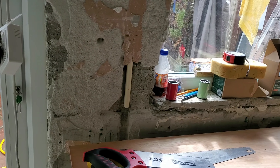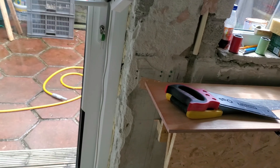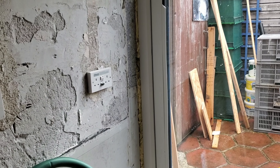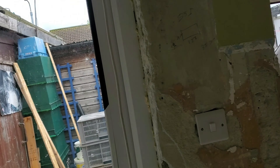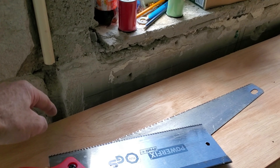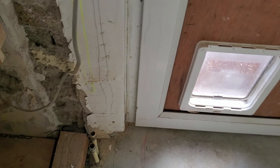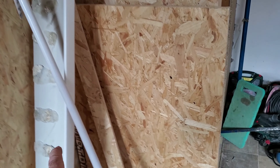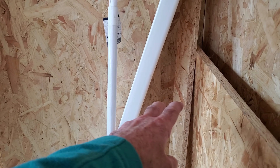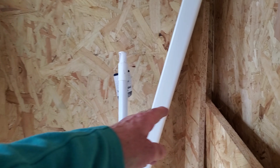As long as the sockets and stuff's done. I extended that down, so if I run a double socket underneath — there's the electric screen on a ring circuit. The cable comes down to that and the cable comes back up again. I'll bring the cable down here, the socket — the cable will run along the back — and then I'll have another socket here, go up there and across. I can't have any sockets too close to the sink, but this is where the computer's going to go, so no harm to have a bank of sockets there.